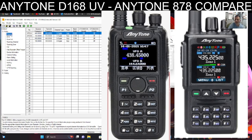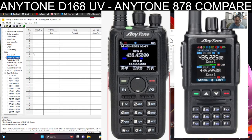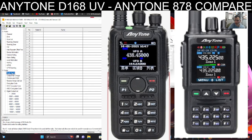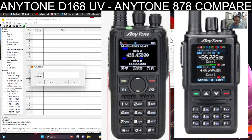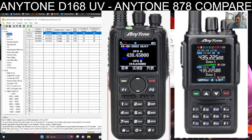It's identical software — you've got channels, zones, and then you create digital contacts and talk groups, the usual software. I won't program it right now but I will do a video programming it. You've got to put in your DMR ID — find the coin, use it for a while. Where it says Radio ID, put in your DMR number, like 2341437. I had to double-click it. You can have multiple users for this radio. Contacts is a really important one — all your talk groups, which are also called contacts.